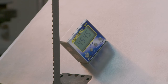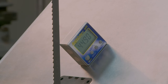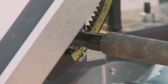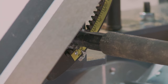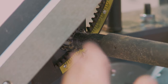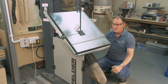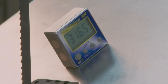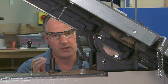My angle cube is now saying 44.9 — this is really accurate. Looking at the protractor it's pretty accurate but not quite spot on. There is a little tiny screw in here which I can undo and move the pointer to set it nice and fine. You can set to 90 degrees off a square or 45 degrees off a 45-degree square. What's more difficult to set up is if I have a drawing and I want an angle of 32 degrees — I can't set that up with a square or 45, and an old-fashioned sliding bevel isn't going to help much either. But with this angle cube I can set it to exactly the angle I want.